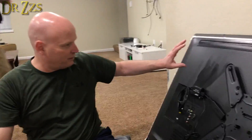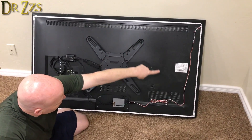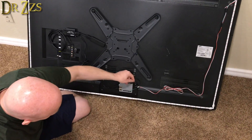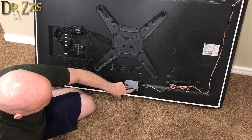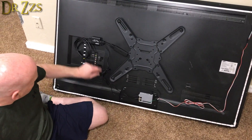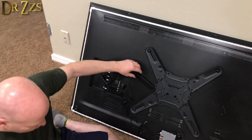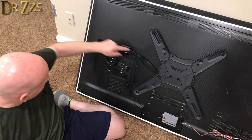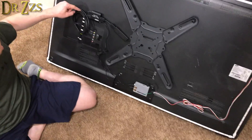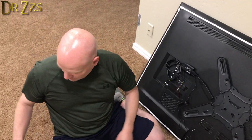Let's run through everything: we've got the LEDs on, wires from the LEDs to the Pi, they're getting power here, this is where we connect the power supply, and they're getting data signal here. The Pi is getting power, we've got power to the HDMI capture device, we've got the HDMI input, we need to remember not to reconnect the power to this thing, and we've got the output. We're golden — let's hang this thing back up.